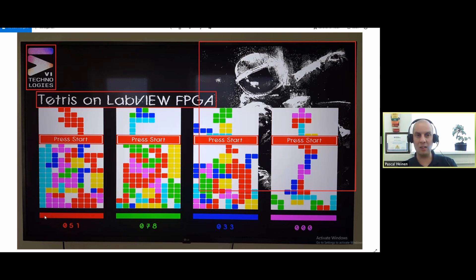The rectangles you see on screen are done programmatically - I'm not saving anything in block RAM. I just ask: is the pixel I'm currently updating inside this rectangle? If yes, then draw the color. The biggest part is the game itself, which we'll come back to.